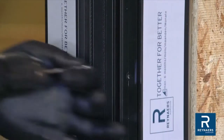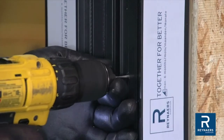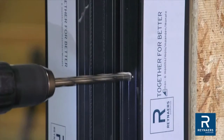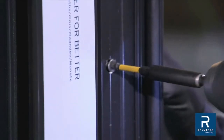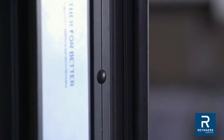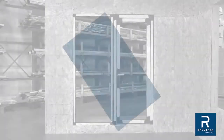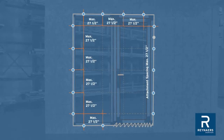Drill field pilot holes and locate shims near the connection points to prevent buckling of the frame. A small pilot hole should be drilled first, penetrating the door frame and building structure, followed by a larger pilot hole, which allows the fasteners to pass through the exterior of the frame and hold the units in place. Once completed, if desired, cover holes with plugs supplied by others. Connections are required on all sides, 8 inches maximum from each corner and 27.5 inches between attachments.